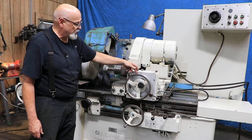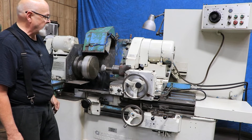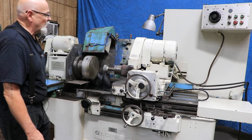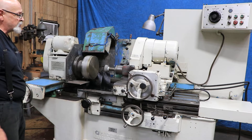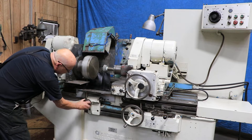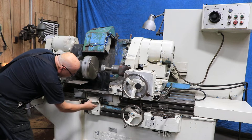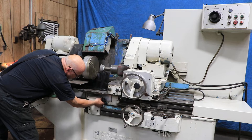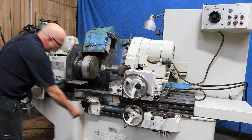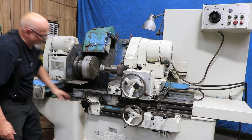Now it's going to take a long time to get to zero because this right now is not set up optimally for grinding — it's just for a demo. You would want to have this maybe less than a tenth or so before zero, and it'll make three or four passes just to take that one tenth. Down here we have a mechanical stop with a very fine feed. You go very slowly. You have a rotary thing here with adjustable stops, so that would be if you were working inside a diameter that had multiple steps going back. You could set each one of these to represent one of those depths, and it comes up against a solid stop.